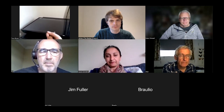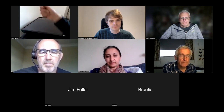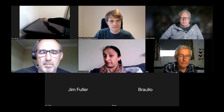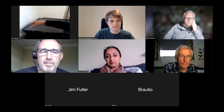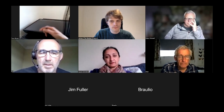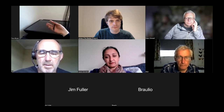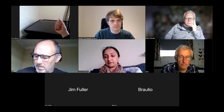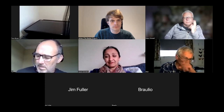And the only way you can see the image is if you take a really bright torch, so I've got an LED headlight, turn it on and put it really close to the screen, and then you can just about see it says no channels have been added yet. Or you might see an image moving around, or you might see a Netflix logo or something. You can see that the image is there. Now, obviously, if it's tuned into the regular television, you might hear somebody speaking, because it's a TV program that it's tuned into.